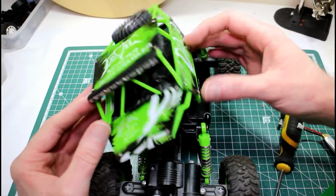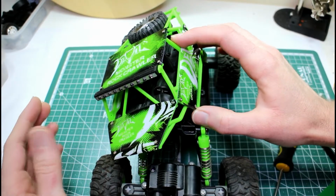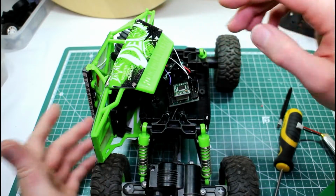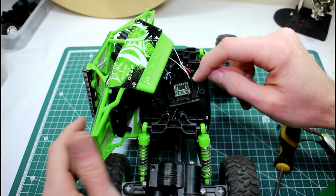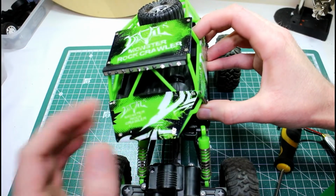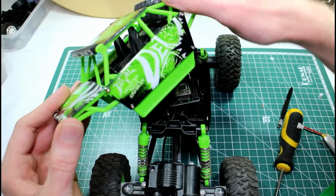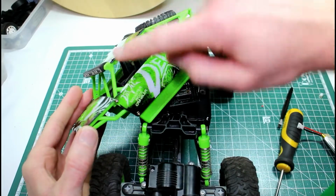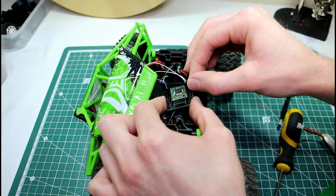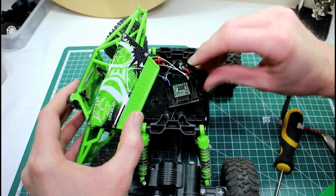Okay, so what I've done in the front here is a row of white LEDs, and in the middle I have four orange LEDs, and I'm setting them up like left and right beacons, so two flash on the right, two flash on the left, that kind of thing. To wire them up, I had one ground wire and three wires from the three sets of LEDs, so the white ones, the left orange ones, and the right orange ones. I put the resistors up in the cab here so you can't really see them, it's very, very low profile, and then I just drilled some holes in the top of the seats there, so the wires actually come along and go in through the top of the seats, come out here, and then I've just plugged these in on the wires that they needed to be on, so just more DuPont connectors, keep the thing simple.